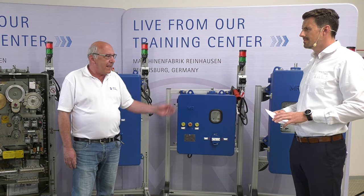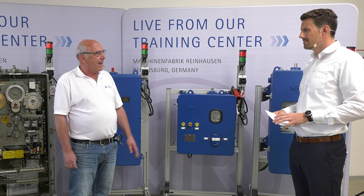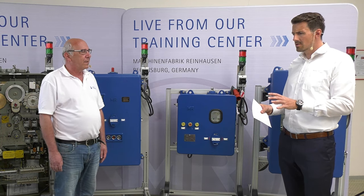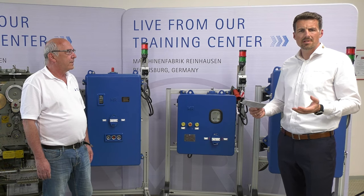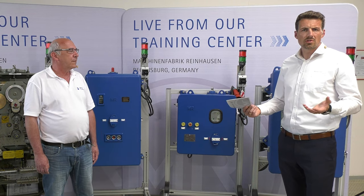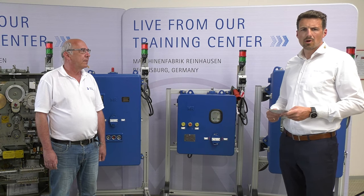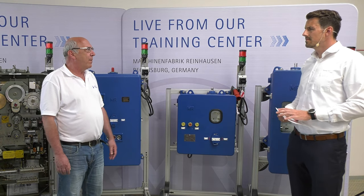What is also on the ED is a belt transmission gear inside, and everything is touch-proof. Talking about non-MR drives, we can also replace other brands like Siemens drives, AEG, Trafo Union, and of course other brands available in the market. For that purpose, we supply an adapter console, which makes it possible to install the motor drive ED instead. So you can replace nearly every motor drive.